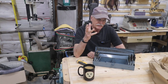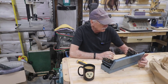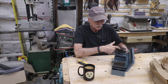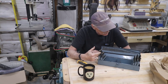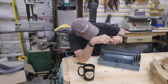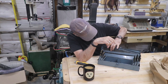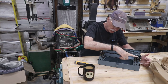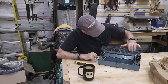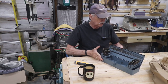Drills — a 115-piece set of drills. I've got all the drills that are in the Norton kit right here, which are in fractions. I have the number drill bits over here. And I've got the letter drill bits here with their indicated diameter markings, and these are the number drills with their markings also in the diameter of the drill wire.